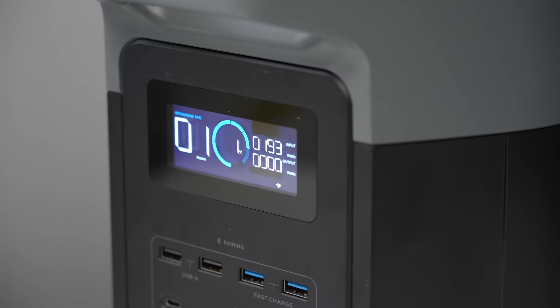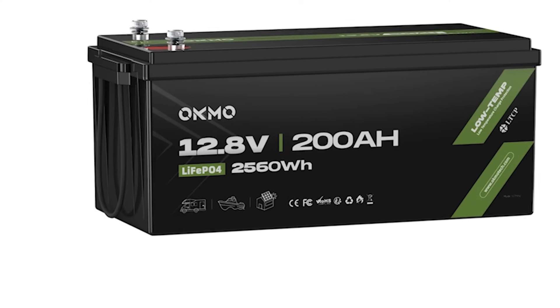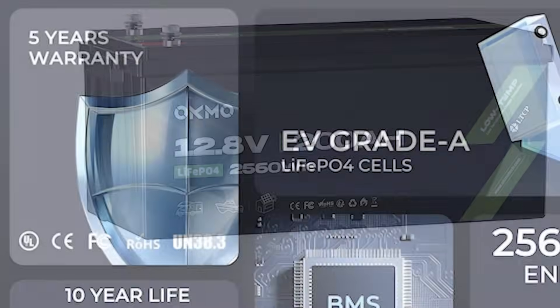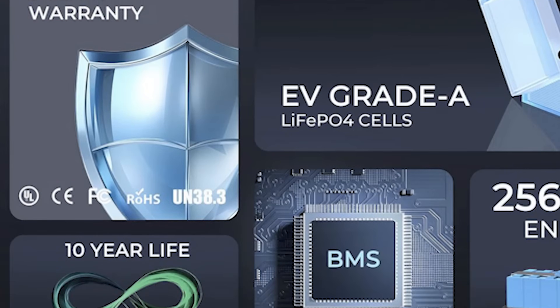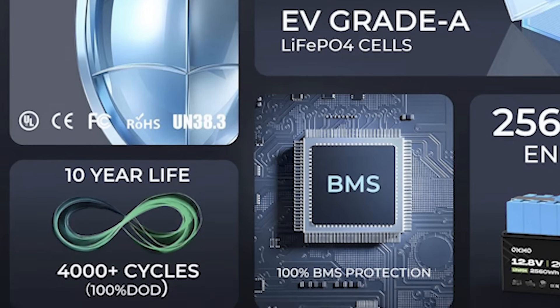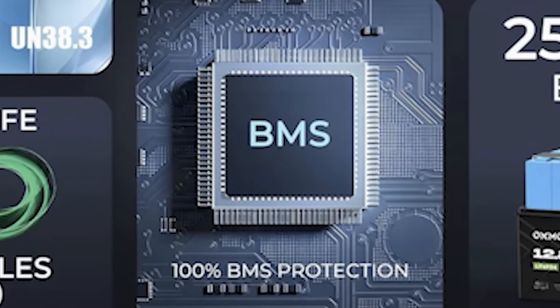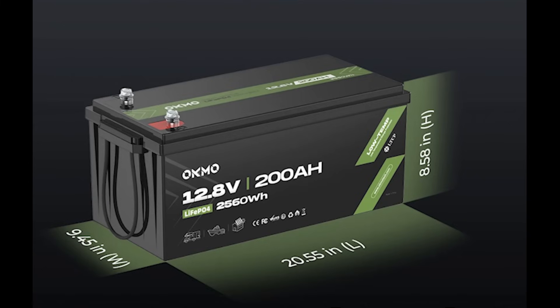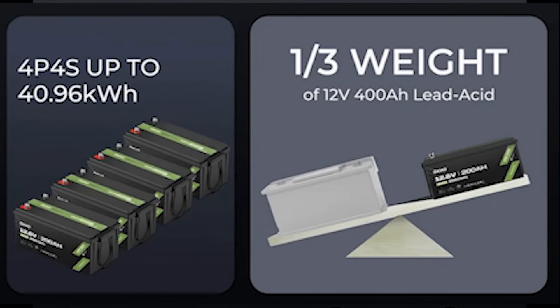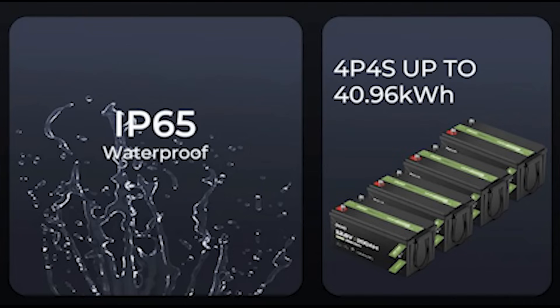While we wait, here are the details on this Oakmo battery. It's a 12.8V 200Ah lithium phosphate battery. It comes with a 5-year warranty and can be cycled 4000 times at 100% depth of discharge. It's equipped with a 100A battery management system for safety. It weighs 44 pounds, lighter than my big power station and definitely lighter than old lead-acid batteries. It also has low temperature protection along with an IP65 water-resistant rating.